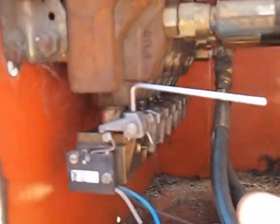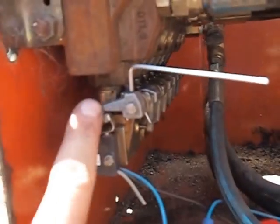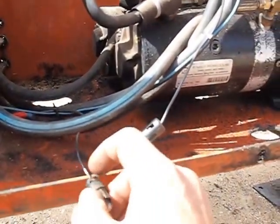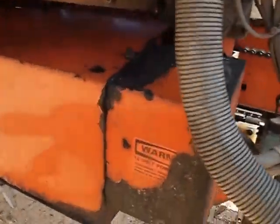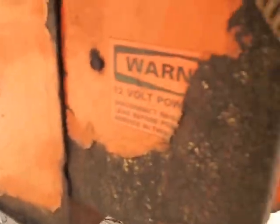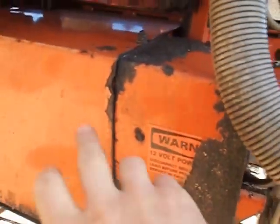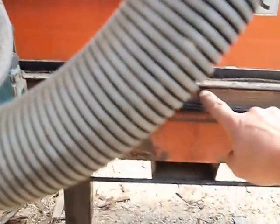Just to recap: alignment on each of the individual tabs for each of the levers, then there's one main tab that presses the micro switch down, and then there's the fuse. You may also end up having a solenoid problem. There's another solenoid down in here which is operated by the key. If I switch off, you'll hear a clonk. Whenever you switch off the key you'll hear that clonking — what it does is cut the power from the battery to the solenoid and then down to your hydraulics rail.